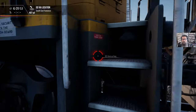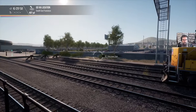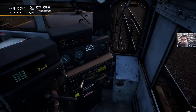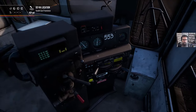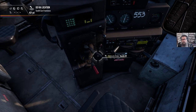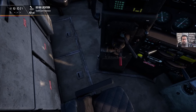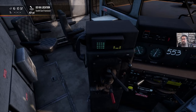We need our locomotives running to do some of the inspections, so we start them up. You go through all of the same activities on this one — the fluids and the like that we did on the other one. In this locomotive we don't want any of these switches turned on because in the trailing loco you don't do that. We want to make sure the brake is cut out and in handle off, which is fine, and the independent brake is released, which means the brakes in this locomotive are being controlled by the other one. The MU2A valve should be trail 24 — not lead or dead — so we run it into trail 24 because it's the trailing locomotive.